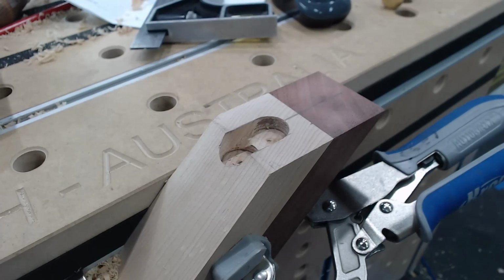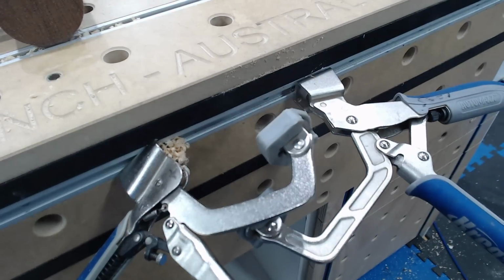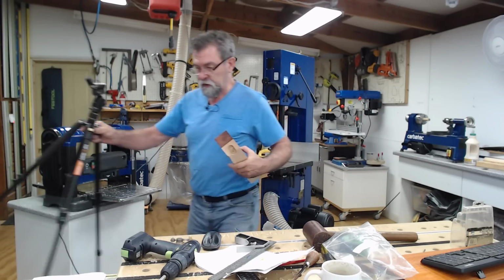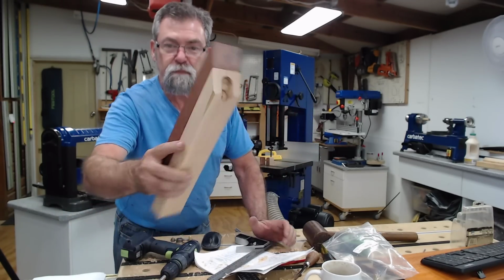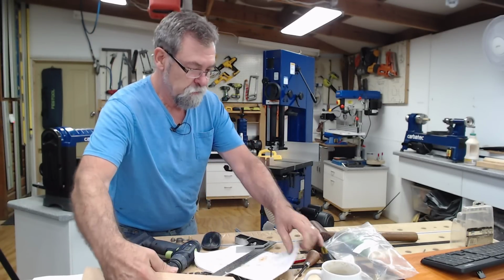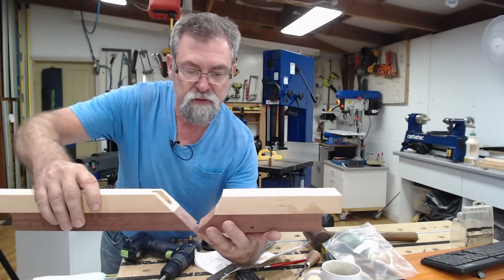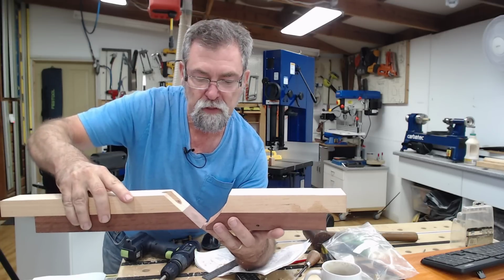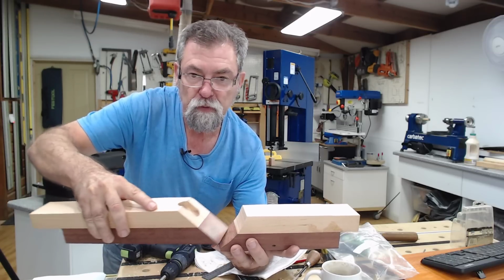But look, I'm really happy with this as we're going along. Move that out of the way, and we'll switch cameras again over to here. And move that out of the way. So there we go. That's really nice. So next week, what I plan on doing is sanding the escapement here, so you can see how it's going to go. That's going to be where the blade lives. This is going to be the front of the plane. This is the rear of the plane. The blade will slide down where my little finger is there. And as I say, I'll clean this up with the bobbin sander.